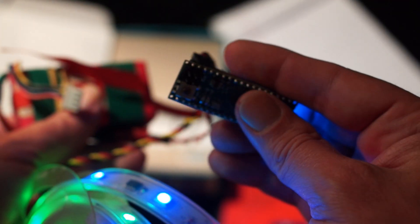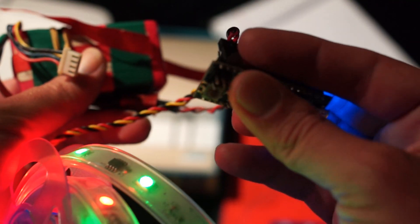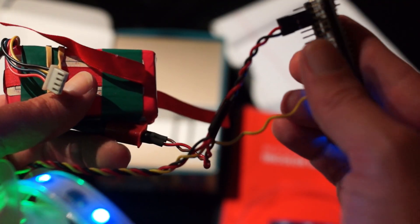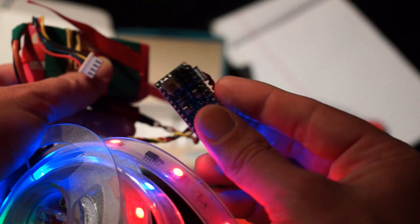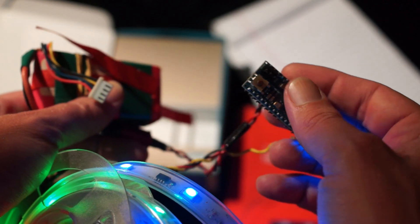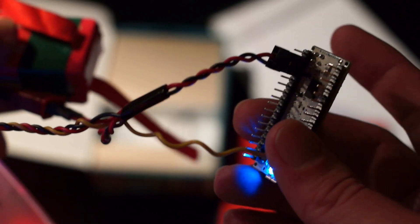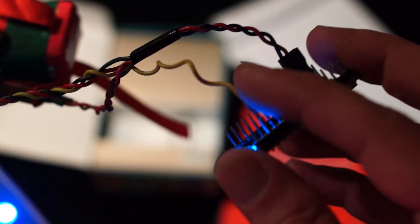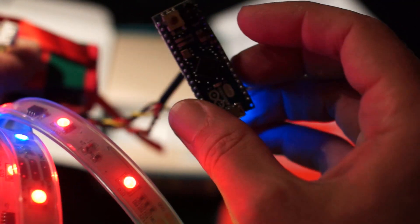I've been running this for a while, and the voltage regulator here is getting a little warm, but it's not hot. There's nothing dangerously warm, so this is going to be fine for our airplanes — to run it for 10 minutes or however long a flight is, it's going to be no problem. That's how it's wired up. You've got 12 volts going into your Arduino, and I've got the data plug going into pin 10 right now. I'll explain that when I get to the code part.